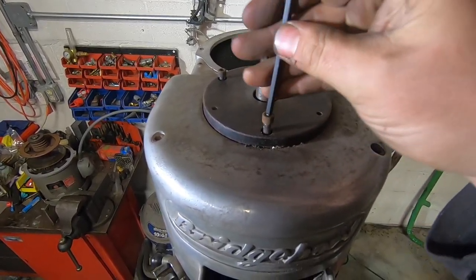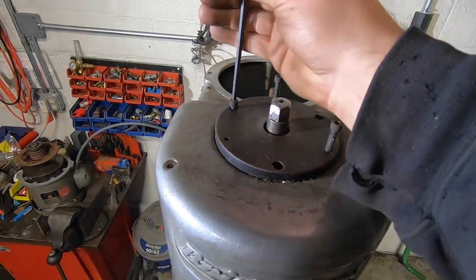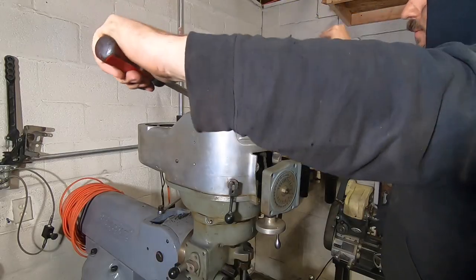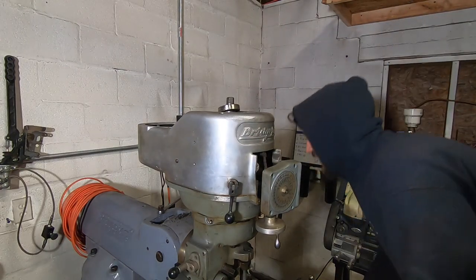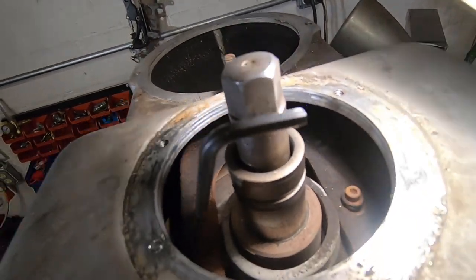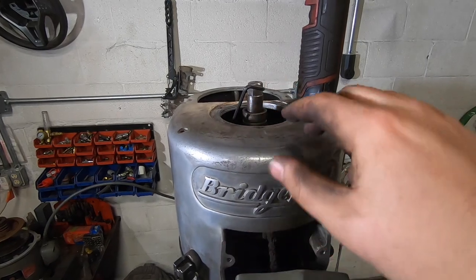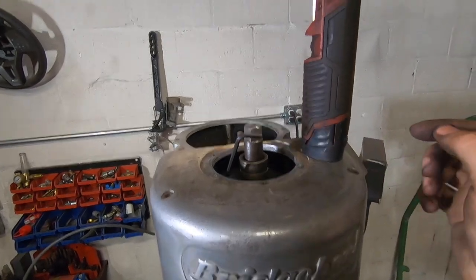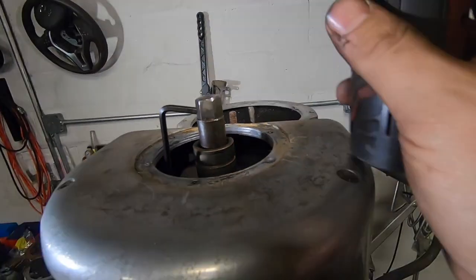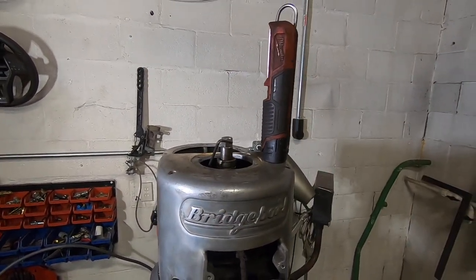Taking off the top plate now — like a lot of things on this Bridgeport, you can reuse the fasteners as little pullers or jack screws. There's an upper bearing plate in there. Inside I can see what looks like a clutch fork. That fork can stay in the cover as one whole assembly, but we have to disconnect it from the top pulley plate using two screws. Back here is a set screw or jacking screw with a lock nut — that's how you calibrate your speed. The Bridgeport tells you you're doing 600 RPMs and you can tune that screw so the belt actually runs at 600.